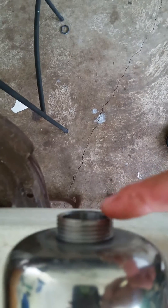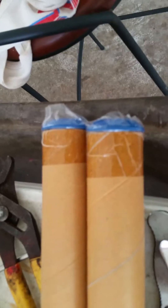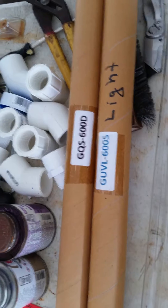So again, if you're putting your bulb in and you notice it's hitting the spring at the bottom of the quartz sleeve but not going all the way down, it's probably because the sleeve itself is sticking too high. If you keep jamming it in, you're going to end up cracking that $40 sleeve like I did — and then you have to buy another $100 bulb like I did. Hope that helps anyone troubleshooting their Greenway UV light. Have a great day.